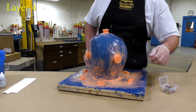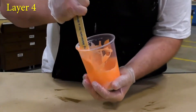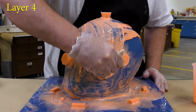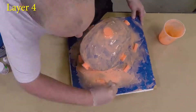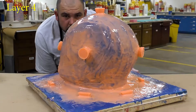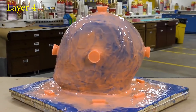We can go ahead and remove those pins before applying the final layer to our silicone mold. This layer does not have any thickener — we're basically mixing one-to-one silicone and then brushing it on over the entire mold to encapsulate everything. Make sure you cover those keys thoroughly. Now we're going to brush on the silicone over everything and let this fully cure for six hours before moving on to the support shell.